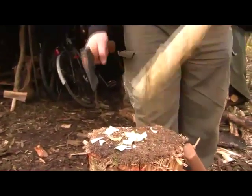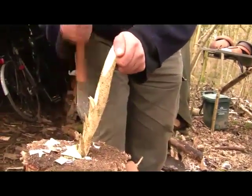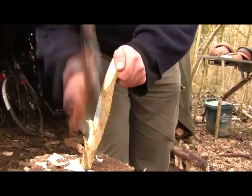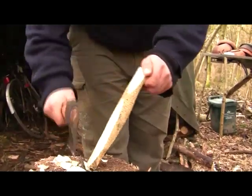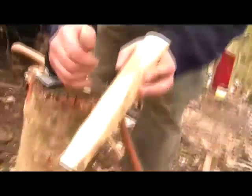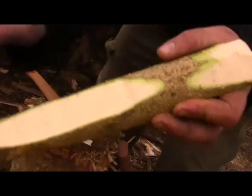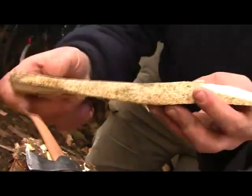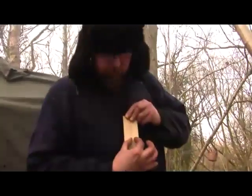We'll take off the thickness from the back doing those stop cuts, then a steeper angle and clearing those off, trying to leave a nice clean cut. The reason you want a nice clean cut is that each one of those scars is going to send a crack going down along the fibers. You don't want to come to your finished spoon and find a crack going all the way down. I'm leaving quite a thickness where the neck of the spoon is going to be thin, to keep it stronger.